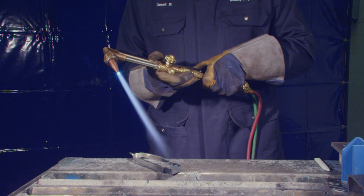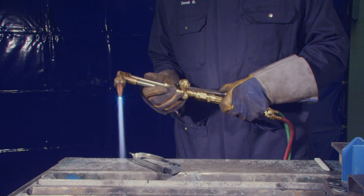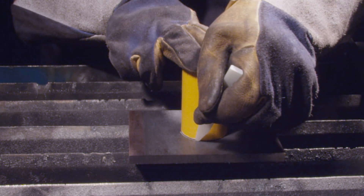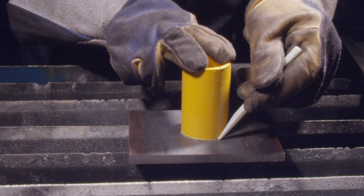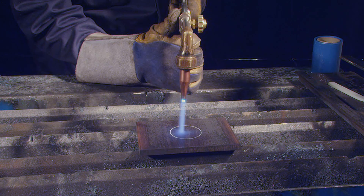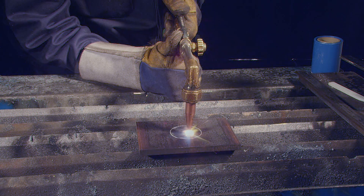It is recommended that you cut the hole first, as this will allow you to pick the roundest side to place at the bottom to provide optimum fit for the pipe. Begin your circle cut from a comfortable position, first preheating the material to kindling temperature, then piercing a hole within the pattern.